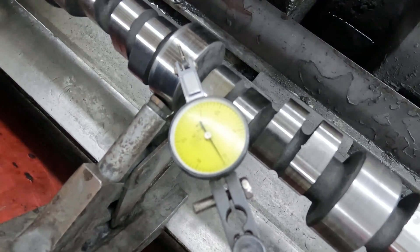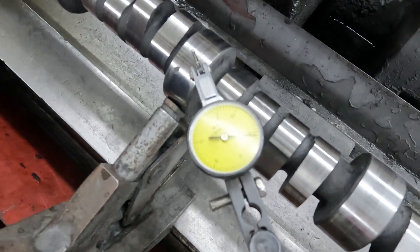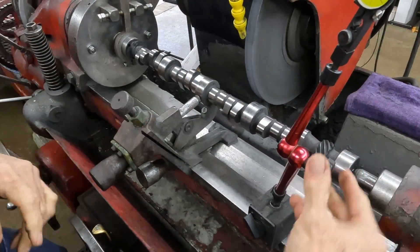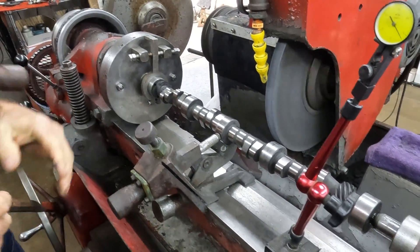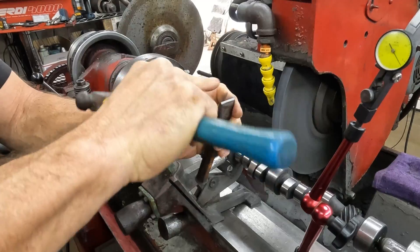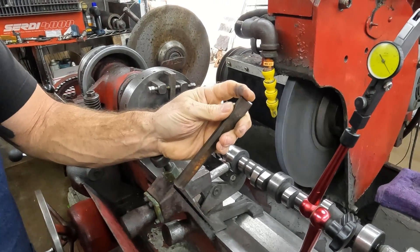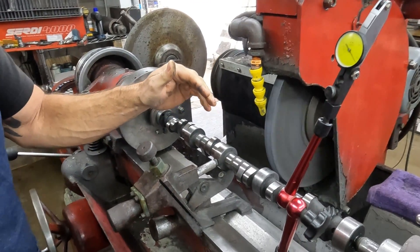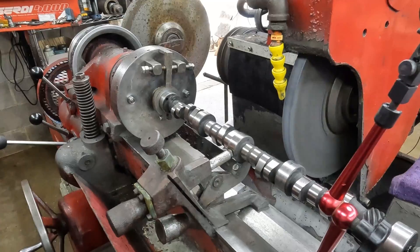We try to keep them under one thousandth - one is definitely acceptable. So we'll bring it to the low side, which is probably counterintuitive, but we're not actually trying to push it straight. Let me move the indicator out of the way. What we're doing is - I've got a couple of these - it's just an old chisel. We make a blunt nose so it's not sharp, so we're not cutting into it. What it's actually doing is expanding the metal. It doesn't take much at all, but we expand the metal on the low side and that brings it back straight. It's the same way we straighten a crankshaft or a lot of other stuff.